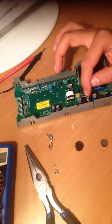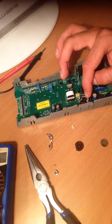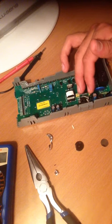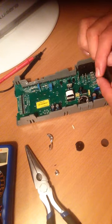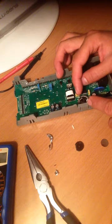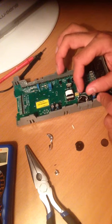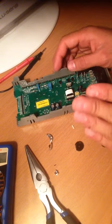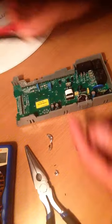There are two ways to fix it. If you don't know how to fix the fuse, you can connect the two wires together to bypass it — but I do not recommend that; it's a fire hazard. However, it is a way to diagnose the problem: if you don't have a multimeter and want to check if the fuse is blown, bypass it temporarily. If power comes back to the dishwasher, the fuse was the problem.